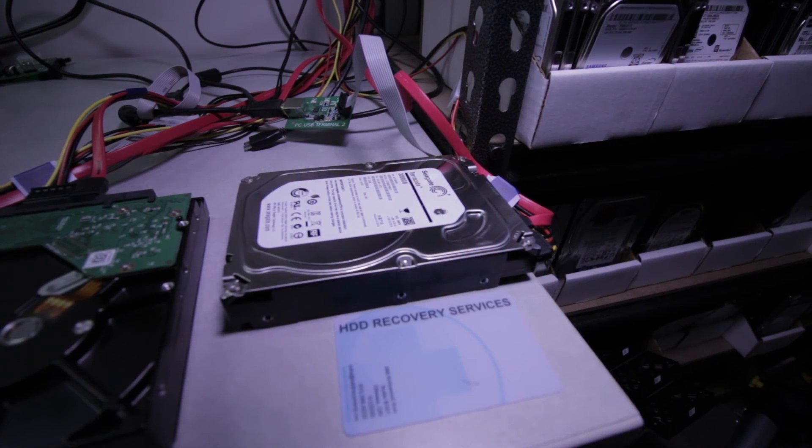It gives access to the utility. Just looked at the drive — it was a Mac drive, used with Mac, formatted as HFS type file system — which is great because the entire catalog was captured just now. I have a full duplicate off of it. Analytics on HFS catalogs do tend to take a little longer than MFT records, so that's going to take a few minutes. Once it's ready I just have to put checkboxes next to the folders that I want to image and begin the imaging process. It's a lot of information to grasp, especially if you haven't worked on these tools before.